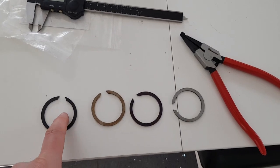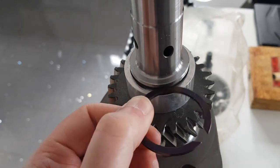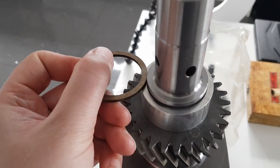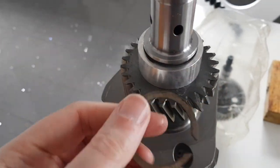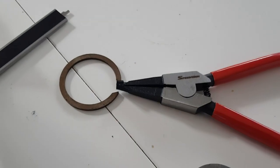These are the four different circlips available, from 2.1 through to 2.4 millimetres. The 2.3 won't go in — that one won't quite fit. Trying the next size down, 2.2 — that fits in around there and also around here, so it basically fits all the way around, nice and square and straight. So that's what I'm going to go with. To fit it I've got these pliers which have serrated teeth on them to grip it, so I'll be able to grip it in the pliers and push it over the end.